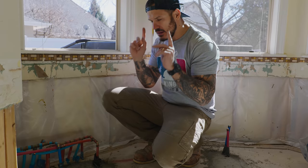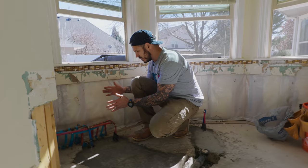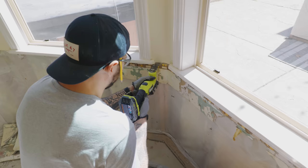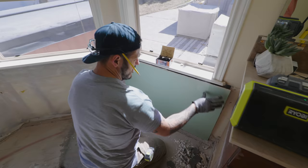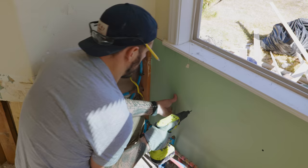This is the next day — the concrete dried great and is still curing. The mission today is two things: add green mold-resistant drywall to wrap this area, and build a little utility box to cover the water lines, wrapping that with drywall as well. Let's start getting some clean cuts, rip some of the old stuff off, and put new sheets of drywall on.